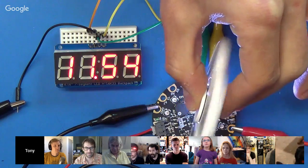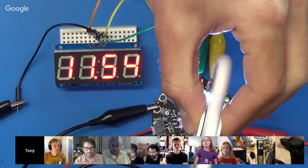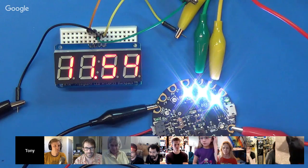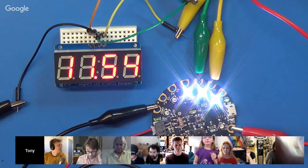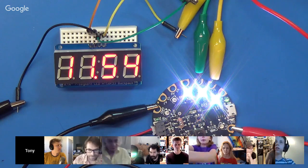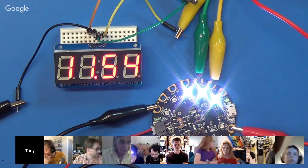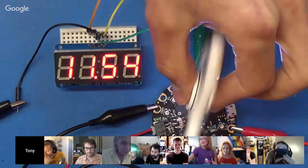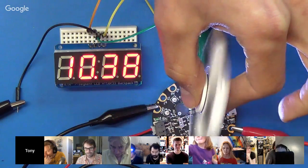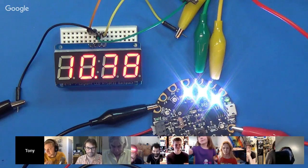But it's pretty cool in that I'm not touching the board. I'm just holding this above the light sensor, and it's that reflection that it picks up, and it's able to detect how fast that sine wave moves. It's not so clever, just a typical frequency detection algorithm. This Friday, I'll do a video where I'll dive into how that algorithm works. And if you're curious, you can see the code, and I'll do a guide on this also so folks can play with it. It's basically a way to measure the speed of your physical fidget spinner. You can't measure the digital fidget spinner that I did, though, because that one has no moving parts, but it's kind of a cool project.